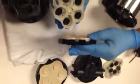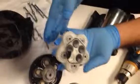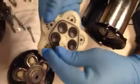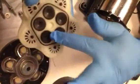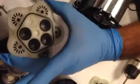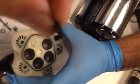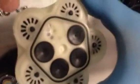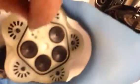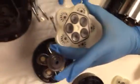Now we're going to show how the pump can be put back together properly, much in the same way we disassembled. We're going to first ensure that the valves are in their place, secure. Let me show there is a nub. There is a small nub there that you see, which goes into this orifice right here. So the valve falls into place like that.